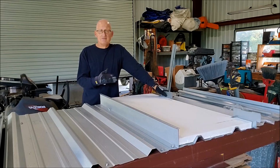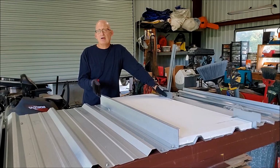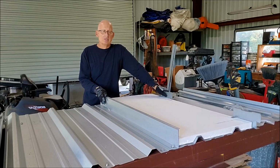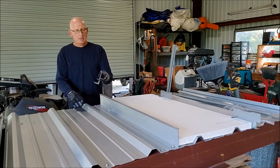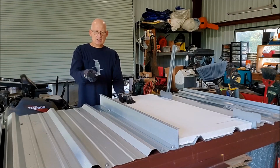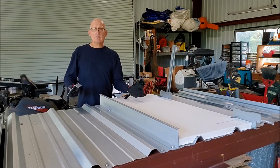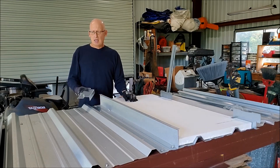Right, so we're talking about a 50, 60 year roof for really not much more than a single ply recover that is just going to be a whole lot better. So it all starts with the idea of using a clip that is extra tall with a tall offset. This clip is a symmetrical standing seam, so I use my 238T panel.